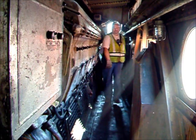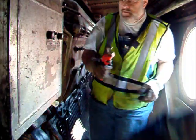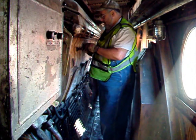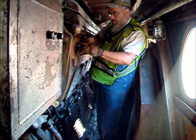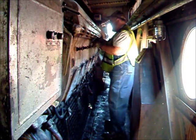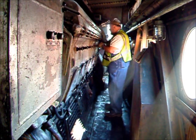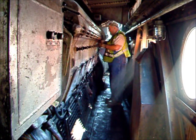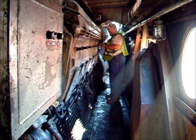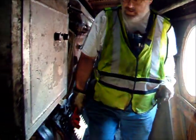I'm going to put six quarts of oil in here. What's the sight glass look like over there, Matt? Fuel glass clearing out? Oh yeah. So what you just saw there was that we flash cocked the engine. This is a two-stroke engine, so any condensation in the engine we needed to clear out. Now we're closing the flash cock valves and we're getting ready to light it off.